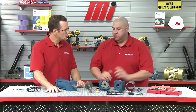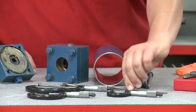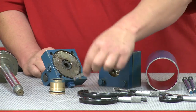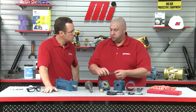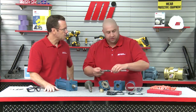Sometimes we just replace the seals, take all the other parts, put it back together, and send them down the road. You do have some tools here as well — tell us how these tools relate to putting this cylinder back together. These are my measuring tools: these are my micrometer set, and this is my digital caliper. These are my telescoping gauges and my six-inch hook rule. These are tools a machinist has to use when building parts. When I'm building a rod gland, you have to use your micrometer and telescope gauge to measure the inside as you're boring it out — grooves for your seals, things like that. Your calipers are used for quick reference when measuring different parts. If I want to know what size this rod is, I measure it — and that's going to be a one-inch rod, .999 right there.